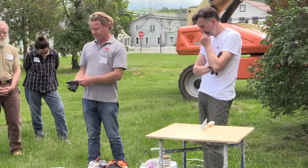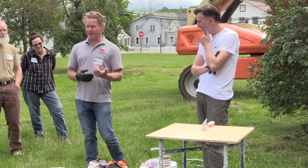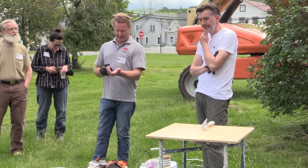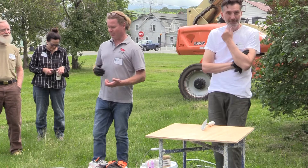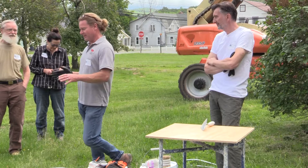One thing to look out for when working: don't get lime down between your glove and your hand. If you feel pain, stop and take care of it. Everybody should carry white vinegar — it's on the opposite end of the pH scale and will neutralize the lime. I have a tendency to work through pain, and once I went in for lunch and blood was just running off my hand.